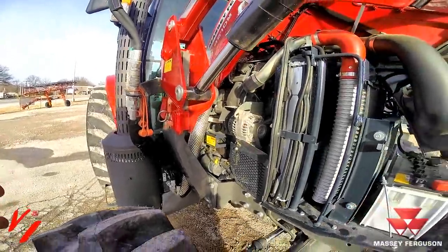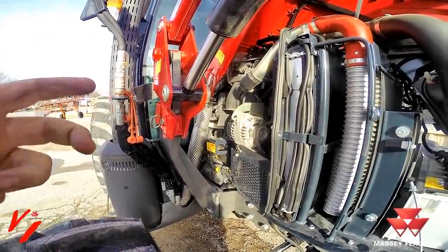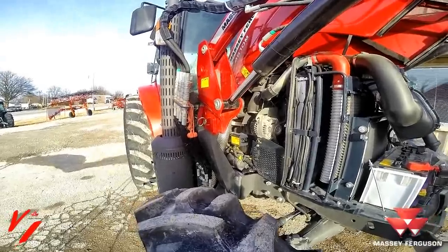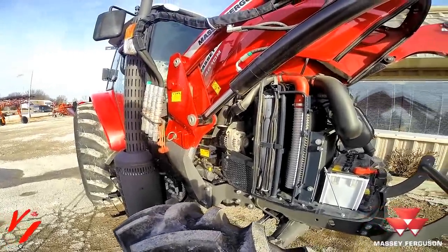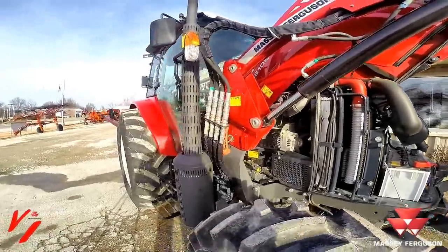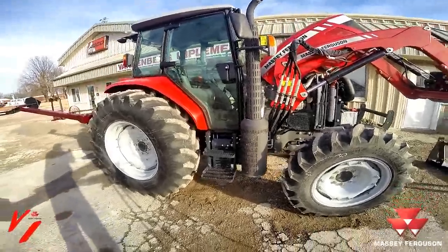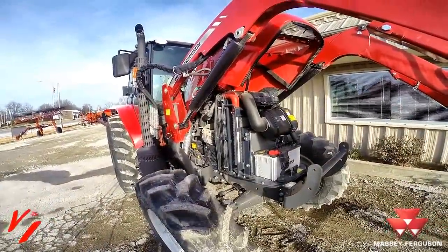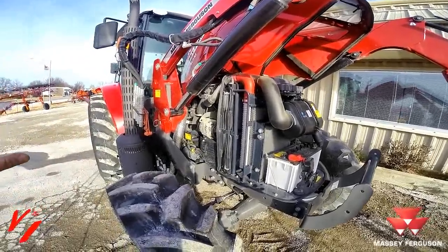The competition uses diesel particulate filters. What a diesel particulate filter does is cool the engine combustion with an EGR valve, which reduces performance but increases particulate matter — and you have to filter that out, requiring a regeneration. This tractor does not have a diesel particulate filter and does not require any regeneration. There's no excessive heat. It only uses exhaust emissions control when you have high exhaust temperatures and are creating NOx gases. We've actually got reports from a customer who had the first generation 4610, then bought a second generation 4610M, asking why he's burning less fuel. It's because the DEF SCR emission system allows the engine to burn cleaner for more power and performance, treating the exhaust after combustion.